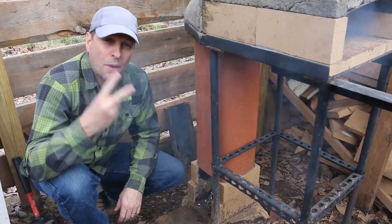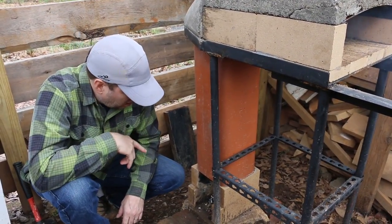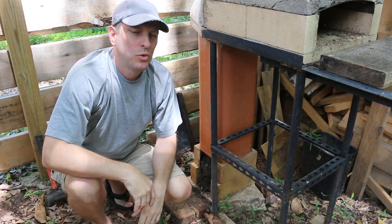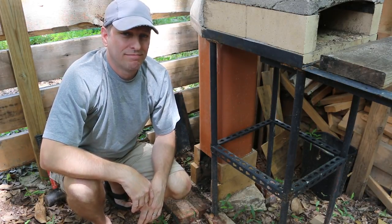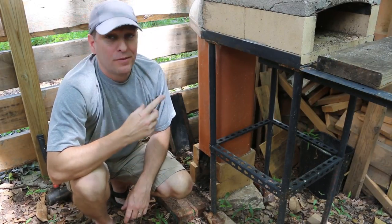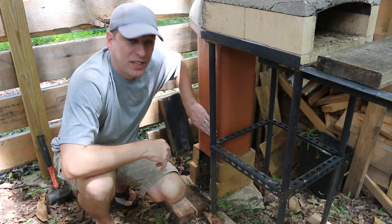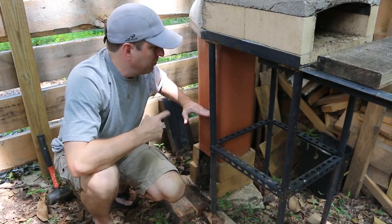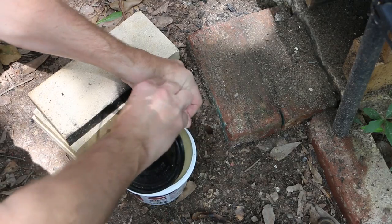I said I had another couple of weeks to wait for the concrete to finish curing — it's actually been more like four months. Sometimes life just gets in the way. But the concrete has cured and it's time to test the pizza oven with a full-fledged fire. Before I do that, I'm going to add thin fire brick and mortar to the inside of this section of the flue pipe to help it handle the higher temperatures down in the bottom portion of the rocket stove.